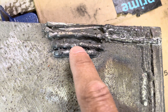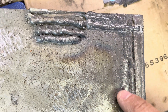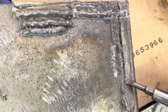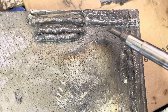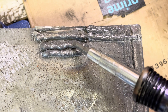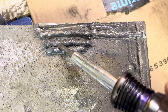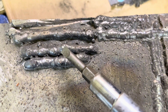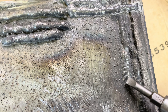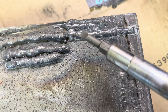I'll show you what the welds look like. I've been practicing my welding a bit. These are the welds done before I fixed the wire speed control, and these ones were done after the modification. The ones done before show a lot more inconsistency in the weld itself. With the slower wire speed, I'm able to do a circular motion which gives me better control over the thickness of the weld.